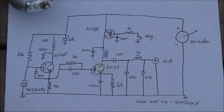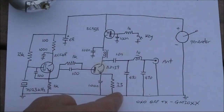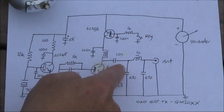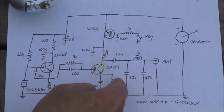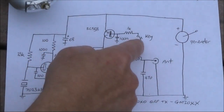Here's the circuit. It's basically a copy of the famous OXO QRP transmitter, developed by GM3OXX around 30 years ago. A one-transistor oscillator — in this case a BC548 — provides the crystal oscillator, and that drives the final transistor, which is a BD139. The output tank is just a simple pi network comprising a 1 microhenry RF choke and two capacitors.